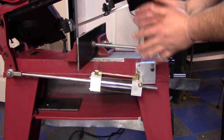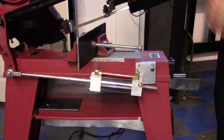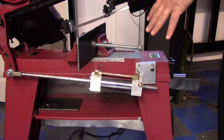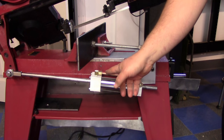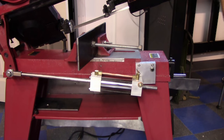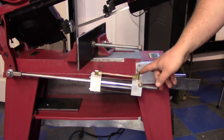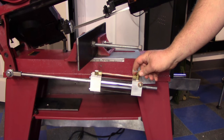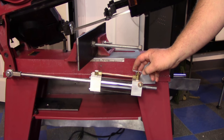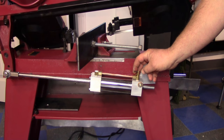You can't leave it adjusted for a feed rate and just lift it up and have it stay. So a lot of you said just put a quarter turn ball valve on the outlet of this, so that's what we're going to do. Also, this handle's kind of touchy. To make it go down, I get about a quarter turn before it starts to go down, and then maybe an eighth of a turn until it really starts to speed up. That's a little too fast.